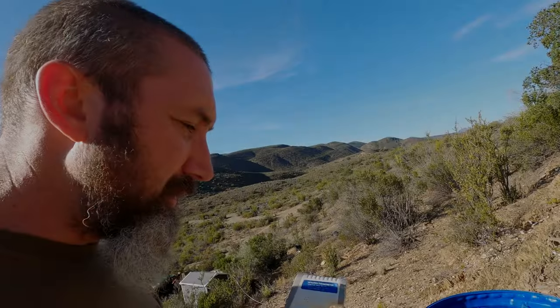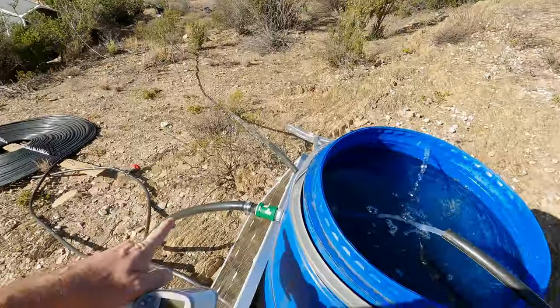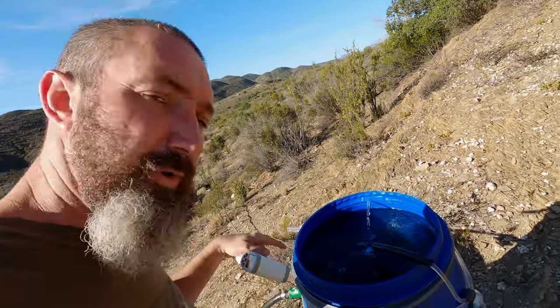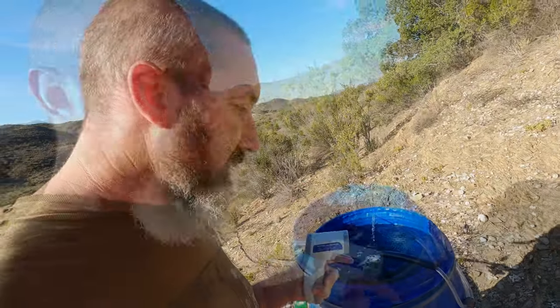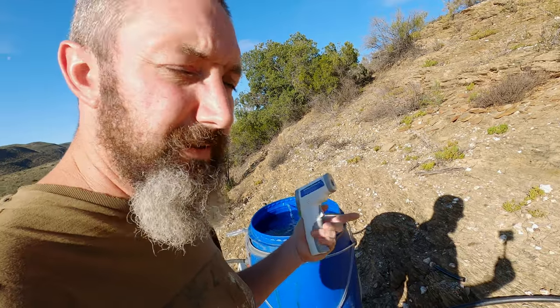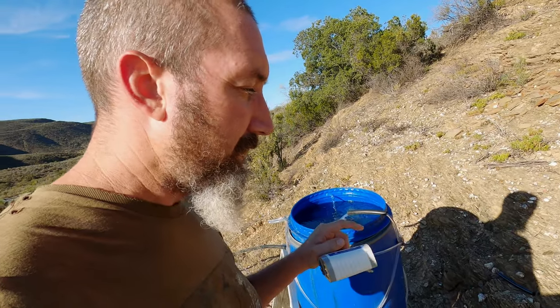I'm sure you can do this better than I did. You need your water mass, you need your heat exchanger coils, and you can either do it with a thermosyphon or, like me when I got desperate, use a pump. If an aquarium pump can handle temperatures up to about 60°C, then a submersible aquarium pump in there would be even better — no noise, and the water would be pumped inside the drum with no external pumps or pipes. You can also put two more tank adapters on there, hook up copper pipe to a rocket stove with a heating coil, and have backup heat for days with no sun.